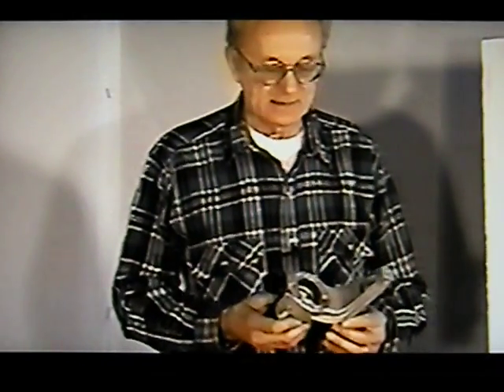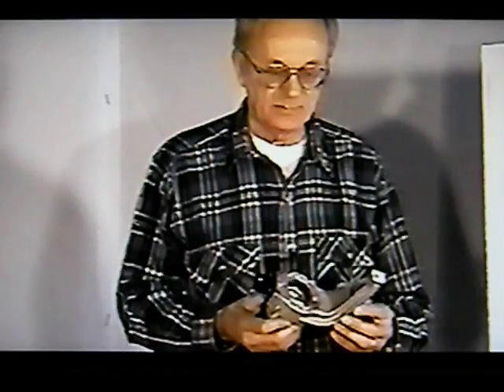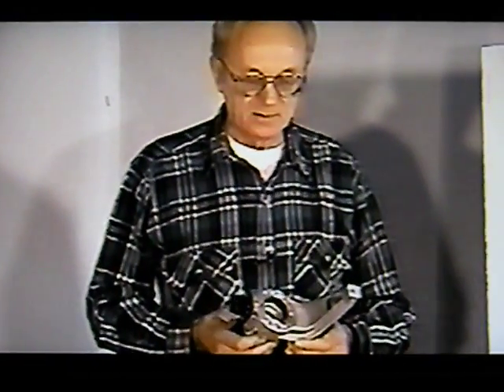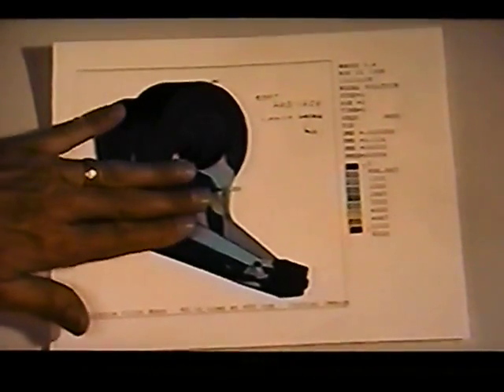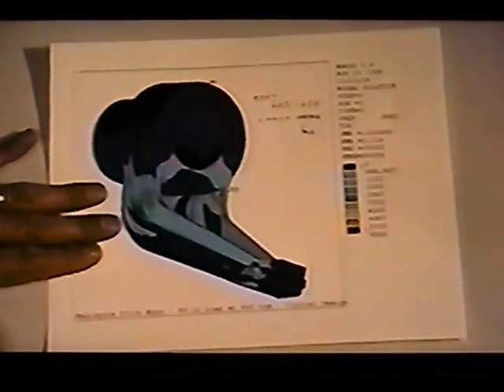Red flags went up all over the place, because in order to build this part strong enough to withstand the 2,000-hour fatigue life that is our goal, some serious redesign had to be done. We mentioned earlier that the cross-section through the arm is where the loadings are highest. Our engineering consultant modeled this part and ran finite element analysis. The first analysis showed the highest loading in that section would be about 6,000 pounds — double what we needed. We needed to be down in the 3,000-pound category to achieve an eight-to-one safety factor for the material, enabling virtually infinite fatigue life at the 2,000-hour target.